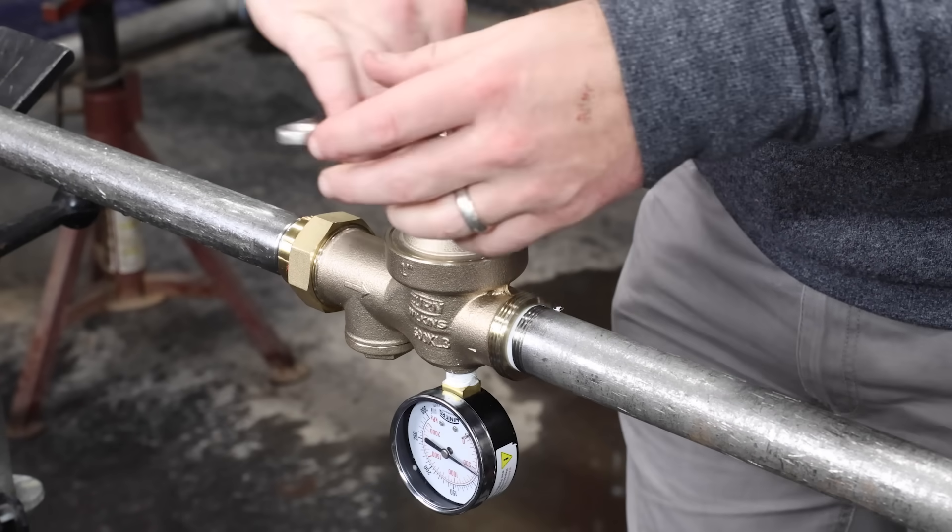The key innovation in this product is the Venturi technology. What the Venturi does is it tricks the valve into opening further than it normally would, because it's putting a lower pressure underneath that diaphragm — making the valve sense a lower pressure than what the end user is actually experiencing. That helps to keep a constant pressure as the rate of flow increases in the plumbing system.